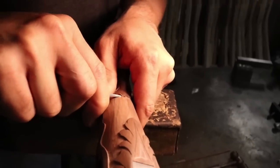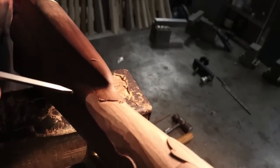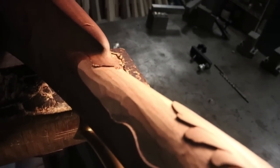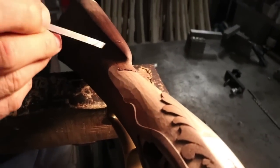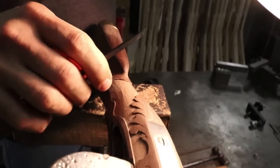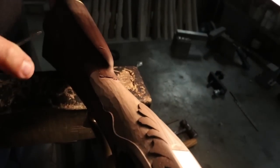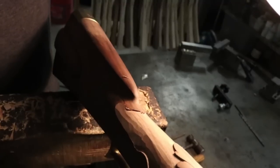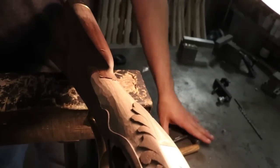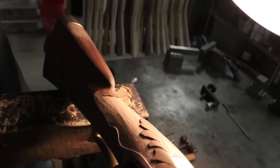One thing I'm not doing is going along the design and trying to cut some sort of groove or channel. I think that's a bad procedure — I know some people have promoted that in the past, but I don't think a V-groove along the design is a good thing. I try to usually work the whole area down more at once. Don't try to work in one particular area, because if you work in one area you make a hole, and you can't make smooth clean cuts in a hole. It sounds simple, but having taught classes over the years, it's a real important concept.